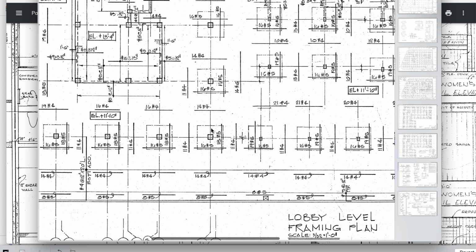So planter box, a lot of it is in the critical shear area, the planter box going from here to here. A lot of it's loaded there with this extra steel, this supposedly extra steel. But remember, he said go work from the center out. So that means it's only one piece of steel across there and then one piece of steel across there. And then 13 inches on center.